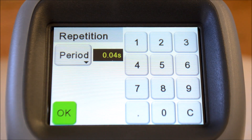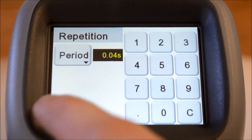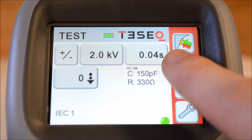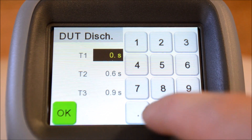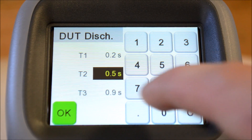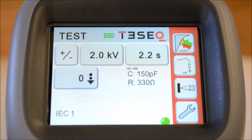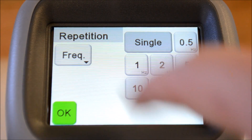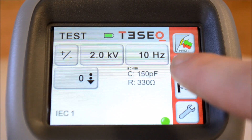Free adjust allows the flexible frequency and repetition rates needed by some R&D jobs or product standards. The EUT discharge mode requires the INA4430 charge remover that comes standard in the NSG 438A. Using T1, T2, and T3, set your timing parameters to discharge, close the relay, and reopen, expelling charged energy through the bleed resistor. This feature is for advanced users. In case you stray and find yourself overwhelmed, default back to frequency mode and it will turn off the EUT discharge mode.